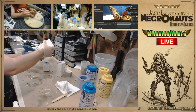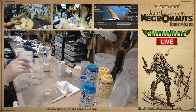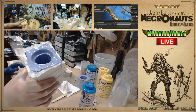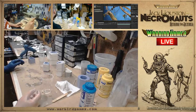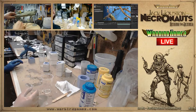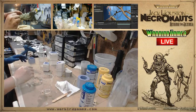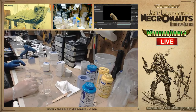And then this guy, see how this is going. This looks pretty thin down at the bottom. I would probably benefit from a little bit extra there at the bottom. This one always ends up being a bit thin at the bottom because it's difficult to get it down there, and it's hard to rotocast it because it has such a sloppy opening that causes the plastic to kind of go everywhere, whereas these pour a lot more securely.